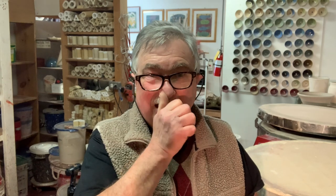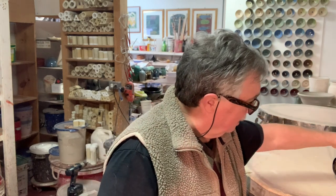The blue and the variegated blue would have run like crazy if it had been over-fired, so I wonder what's going on with that glaze. Anyway, up to the next kiln. This is the second kiln — glaze firing to Cone 6, 15-minute soak at 2225, then 125 degrees slow cool to 1750 with a one-hour soak again.